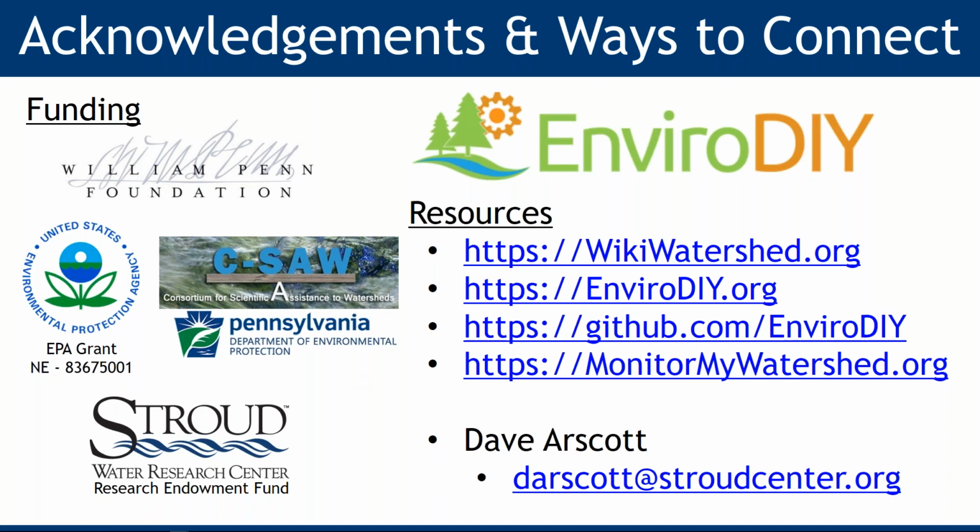Yeah, I didn't touch much on the deployment, but once you have a successfully functioning device, the big challenge is deploying these things. There are so many obstacles to having your instruments survive in the wild. For stream monitoring, we have some video tutorials available on EnviroDIY on how we anchor our devices, our sensors into the stream and hide the cable or tuck the cable to the stream bed and up the stream bank, protect it from critters like squirrels and beavers and other things.